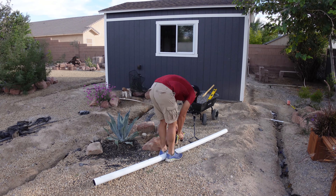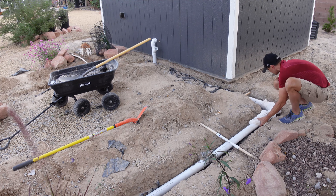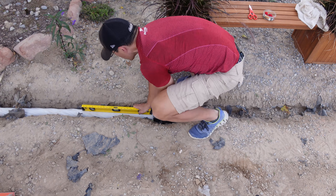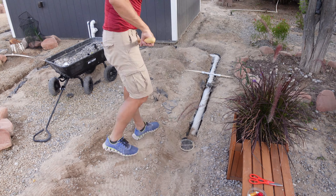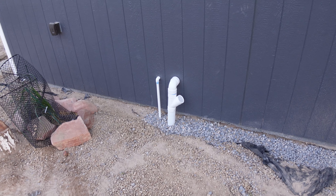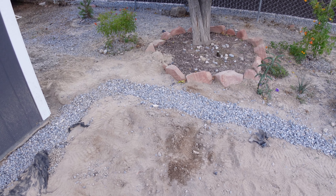Once we got that done, it was easy enough just to run PVC from the well all the way over to our studio, run it up the wall and in. Also, we're not connecting the studio up to sewer — we're using a French drain system, so that means no oils or food particles or anything like that going down the drain, which you're not supposed to do anyway. We ran that trench about 20 feet away from the building, which should give it plenty of space to spread the moisture out and also help irrigate some of our trees back here. All the digging we have left to do is to finish running the service line up to the house and one long trench to run our network cable as well.